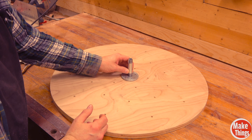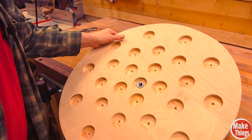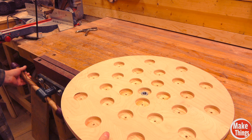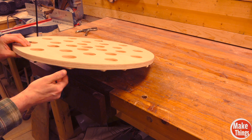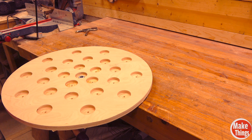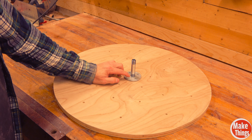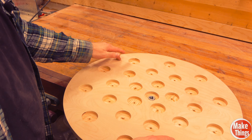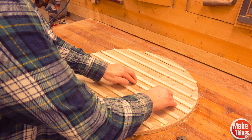The only other metal piece you'll need is a 3/8 nipple that's about three inches long. As long as your dog holes are three quarters inch in diameter, this shouldn't be a problem for you. If you don't have a hole in your table but instead have a bench clamp, this will slide in easily and work just as well. Since the flange is about a quarter inch thick and since it protrudes from the bottom, I used quarter inch strips to level a base, which I glued and added weight to the top to hold it down.